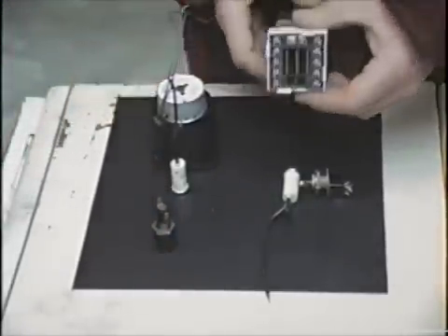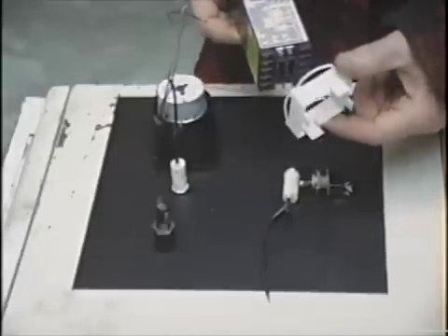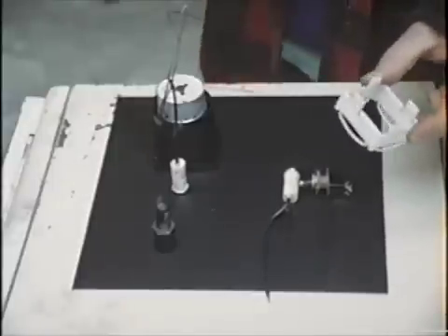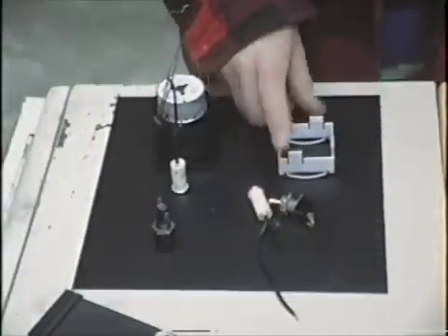These controllers have a little plastic clip on the back for mounting, so I'll use it as a template for cutting the square hole that I need. I've run my red wire and my black wire through the bushings in the back of the box and pre-bent them to fit into the lugs. It's very important that the wire doesn't put any pressure on the lug — that it sits in there nicely.